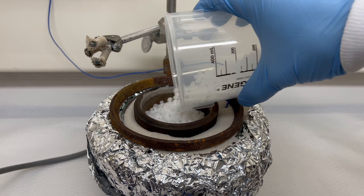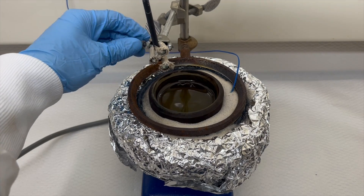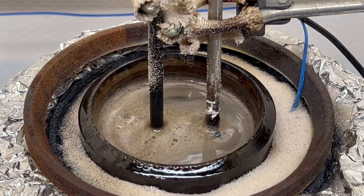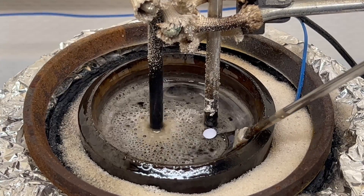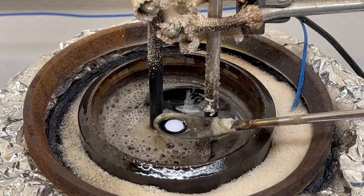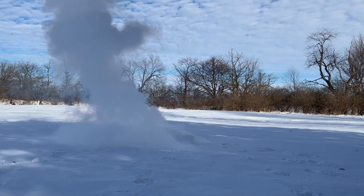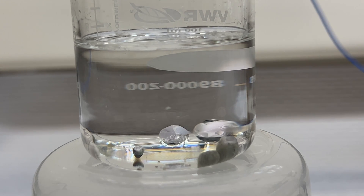We once again fill up the pipe cap and melt the sodium hydroxide, then place the electrodes in and start applying power. Back to where we were — sodium metal is successfully being produced. Throughout testing, I removed the sodium metal as it formed; I did not want a lot of sodium metal to build up for obvious reasons. I used a spatula with a spoon end to collect the sodium from the molten hydroxide bath, which was quite tricky and took a little fiddling.